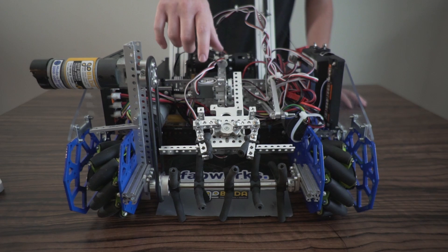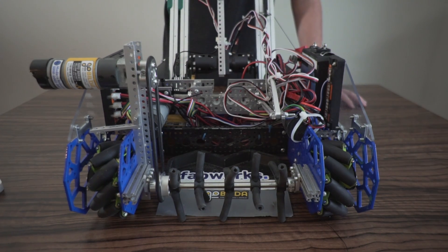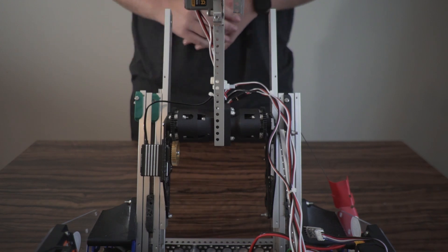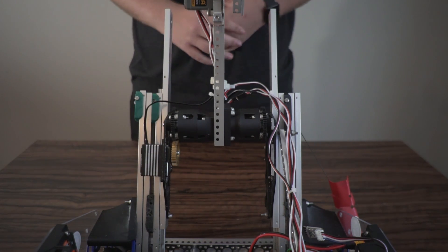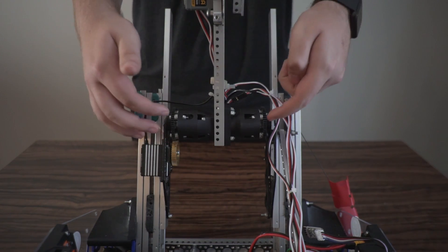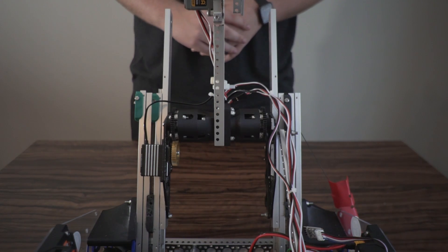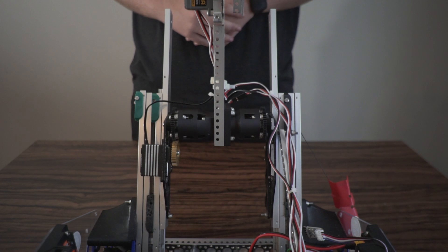The whole gripper mechanism is mounted on a wrist servo — another Gobilda servo — which actuates backwards so we can score properly. For our arm mechanism, we're utilizing metal plates from a previous year's robot. These connect directly to our slide systems on the outer slide and house an Axon Max, which is geared to the arm through Gobilda gears. Something unique is our dead axle design: a 12mm REX standoff runs across both slides, with two bearings riding in 3D printed mounts. Those mounts are combined with Gobilda mini channels, keeping a light and modular arm. This standoff ties the slides together, providing a very rigid and robust system.